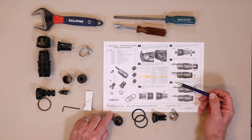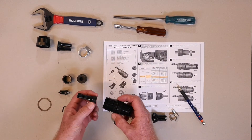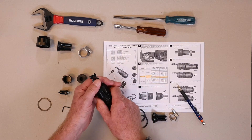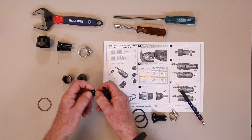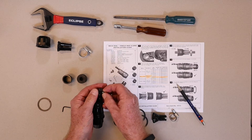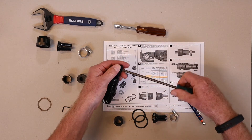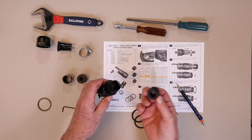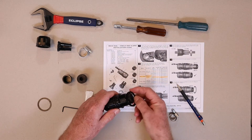Once we've chosen those we can go on and assemble the gland. The first thing we do is take the gland body and screw the central strength member retention bracket onto the front — just do that like this and it needs to be finger tight, quite tight. Then we need to fit the strength member retention boss onto that bracket, so we undo the screw here and screw this boss onto the bracket like this. For this you'll need a Phillips or a posi drive screwdriver just to tighten this screw up. Then we need to install the seal, which just goes in the back here into the back of the body. We need to make sure we put these two spacer rings over here.